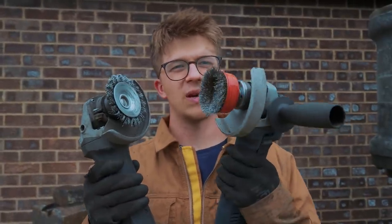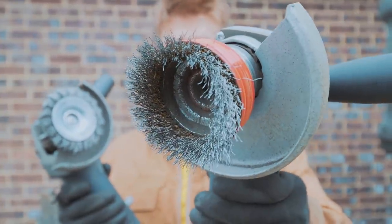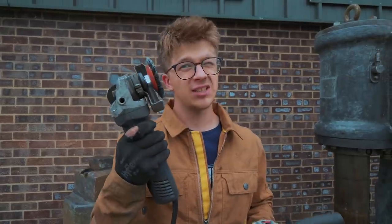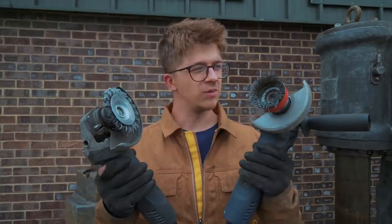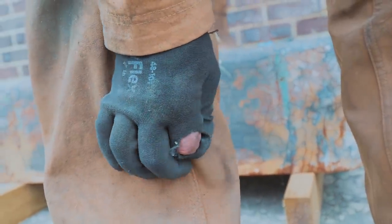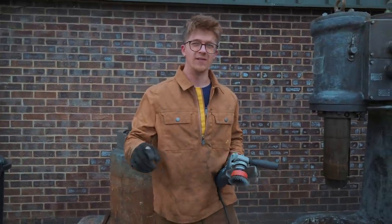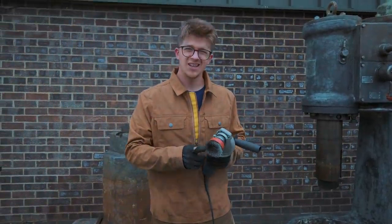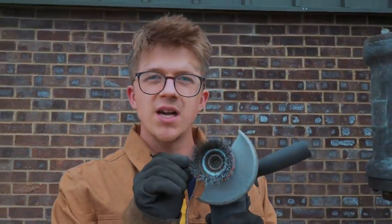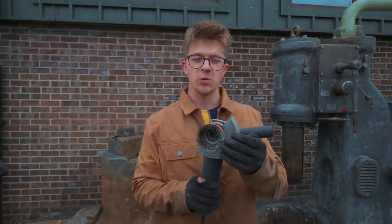You generally have two different types of wire wheels: a straight strand wire wheel in either a cup brush or disc, or a twisted knot wire wheel in a disc or cup. The straight strands are much less aggressive; the twisted knots are much more aggressive — sometimes too aggressive. There is a safety concern: straight strand wheels throw wires really hard, really far, and really fast. As you can see, I am completely covered in wires stabbed into my protective clothing. Because I'm wearing the right clothing I'm all right, but you've got to be aware of it — it can be serious enough to land you in hospital. My mother was restoring cast iron handrails and wire wheeling for days. She suddenly got an infection in her leg, went to hospital, they did an x-ray, and one of those wires had embedded itself two inches deep in her thigh. She had to go under general anaesthetic to get it cut out. So be careful, wear protective clothing especially while wheeling, and know the direction of travel.